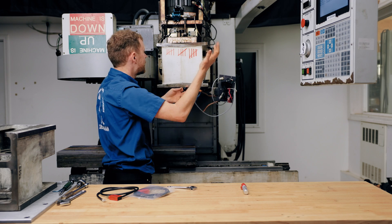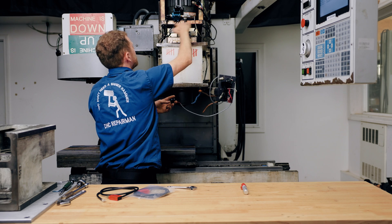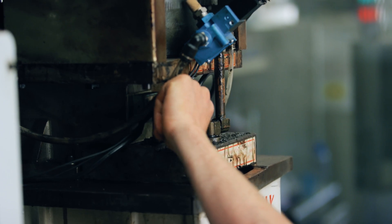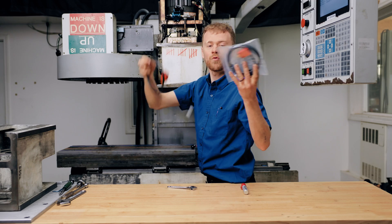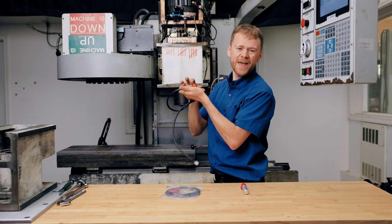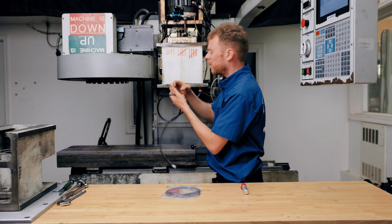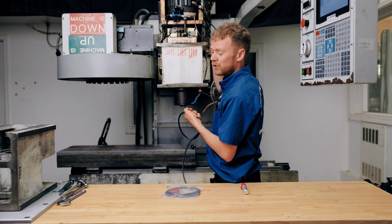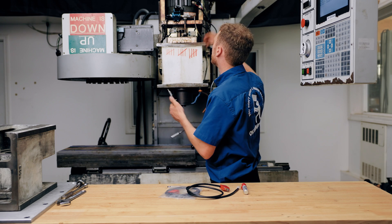You may just need to take it apart. We have a video about how to take it apart, and a video about troubleshooting these switches. But what about adjusting the switches? Notice this is the top ring — this ring contacts the switch when it goes all the way up. Let's replace the switches, because an intermittent switch is a pain in the neck. They aren't that expensive. If you're in here and your switches look old, or the rollers have a flat spot, let's replace the switch. We have a video about how to pull the head cover without breaking it.